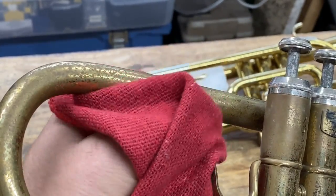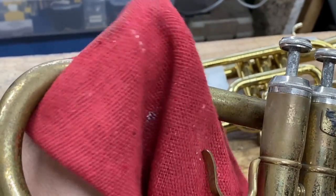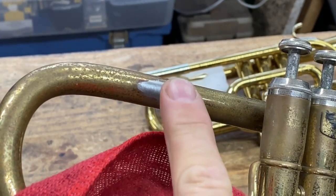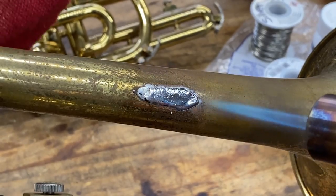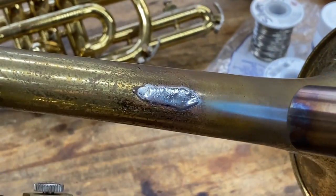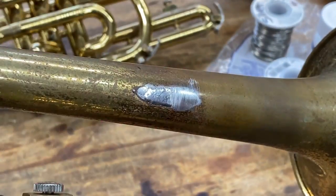And you know you're done when nothing turns. It's all smooth. It doesn't go to liquid. So there's no more solder there. Let's do this other joint down. Come in, heat, wipe, heat, wipe, heat, wipe. And it'll take a couple of times and then it'll start moving, see?